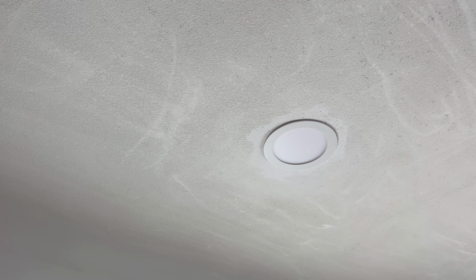You don't need much. So I'm going to go ahead and mix up just a little bit of plaster. Replaster that, let that dry, and it shouldn't take long. This stuff's supposed to set up in like 30 minutes, everyone. So we'll put a little more plaster on there. Again, we're not putting much, so we'll go ahead and sand that, and then we should be finished.